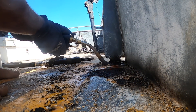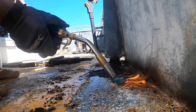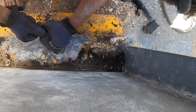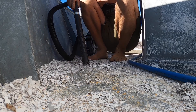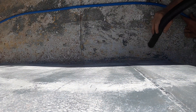There was also some old non-slip tape on the deck which the needle gun wouldn't chip off, so the best technique seemed to be to just burn it off and then get under it with a scraper. The amount of old paint that got taken off was quite staggering in the end — filled so many vacuum cleaners full of the stuff.